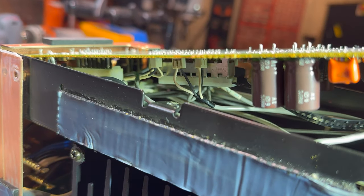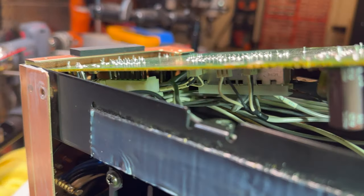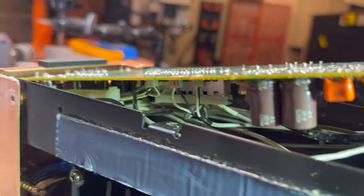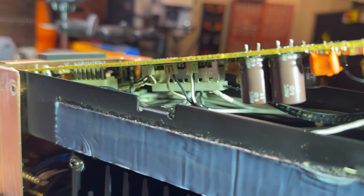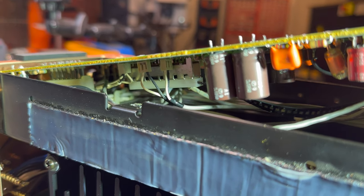ribbon sort of pull cable that's doing the phono switching, and then you've got the moving magnet, moving coil button down here. They're more of those ALPS switches, but bigger versions with the sliding contacts, and that sort of metal cable just physically pulls the switch without moving it to the front of the amp, and just sort of like remote switching. It's very cool. They've been doing that before there was relays and things, and that sort of stuff was more accessible. No problems there.